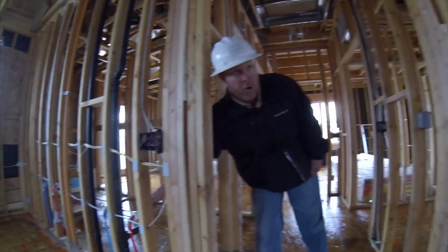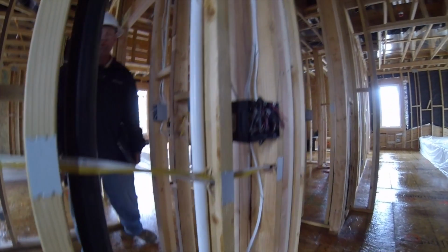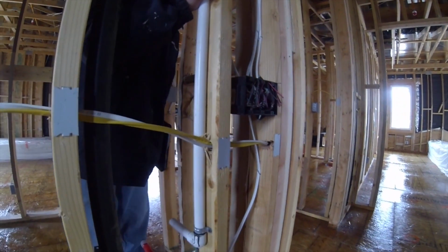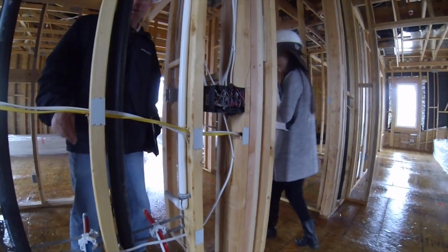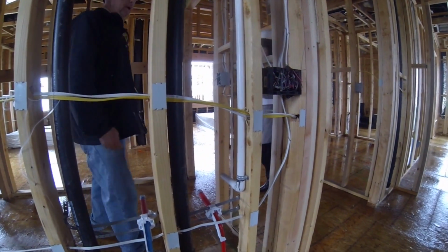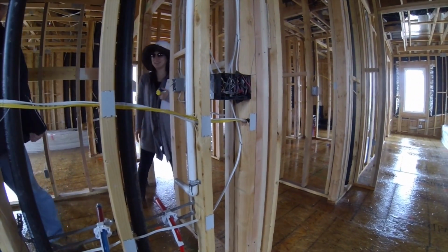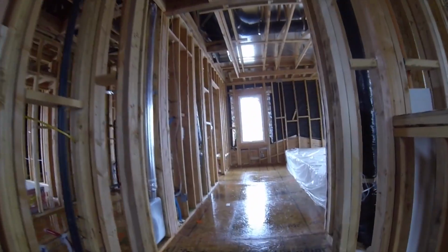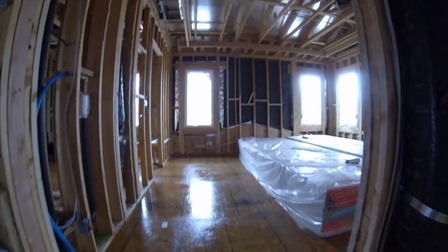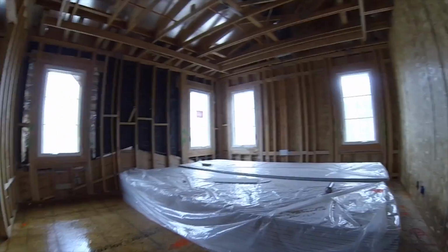This right here, from time to time, you're gonna get a gurgling noise from right here. What that is, that's your condensate line for your AC. So it comes down, it drains in your sink, and when you're running your AC a lot, you may hear this. We know it's not haunted. I promise it was not haunted. But it will make a gurgling noise, only with the AC. It's for the condensation. Pretty solid.